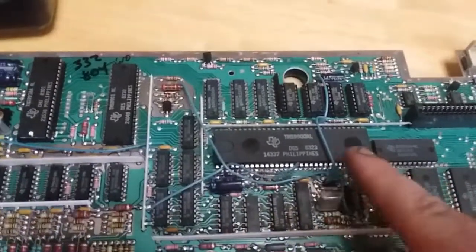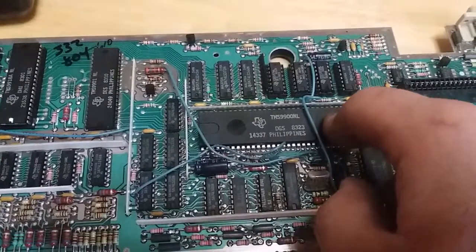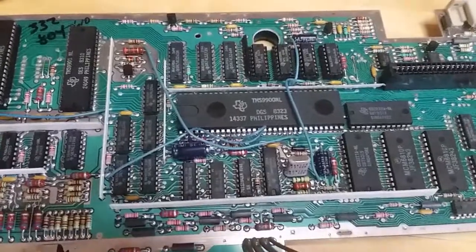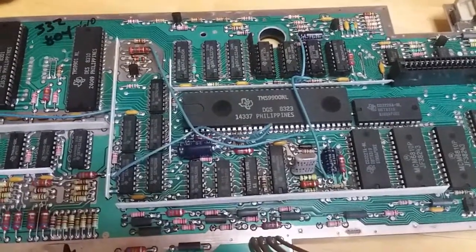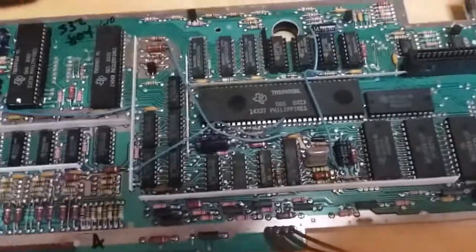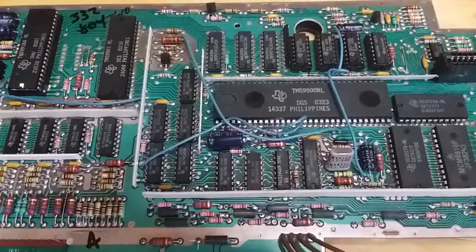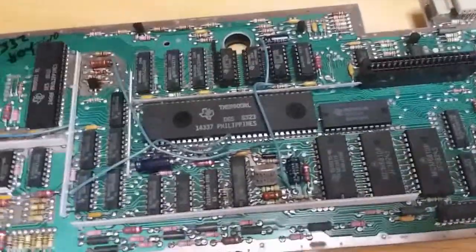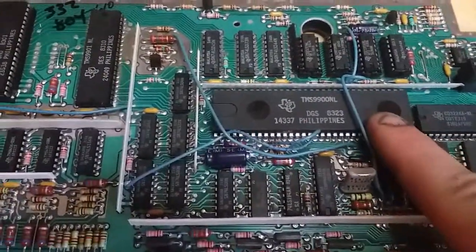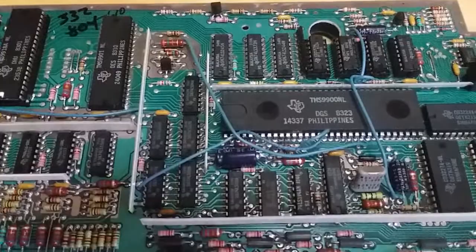But there's a catch, a little asterisk at the end of that. This is actually cut down using a 16 to 8 multiplexer to knock it down to 8-bit. Why Texas Instruments did that, I don't know, but they did, and it actually forced them to create a 4-cycle wait state, which basically means the CPU had to wait 4 cycles before it could run another calculation, which made this machine actually very slow to run typed in basic programs. And in fact, apparently this thing actually runs slower than even the VIC-20, which this is a 3 megahertz processor, and the VIC-20 has a 1 megahertz processor. So it's kind of weird that a slower computer actually runs faster than this, even though this has more memory.